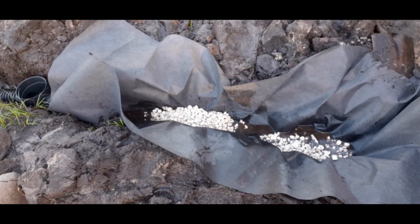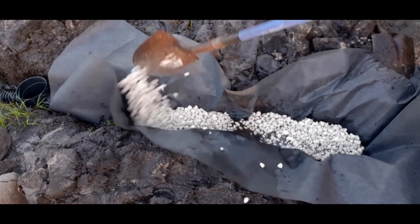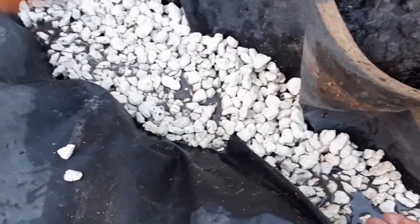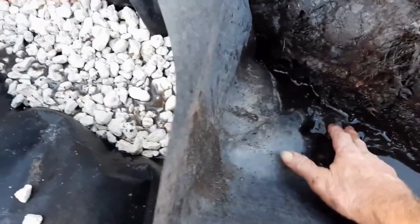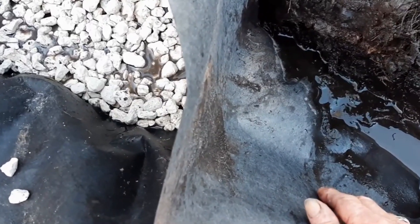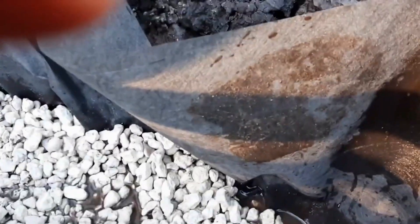So let's build a French drain the right way. We need a base of gravel under our pipe — that gravel allows water to flood up into your pipe without any obstruction. You can see the gravel and there's water getting through that fabric very slowly. Look at the backside — it's just packed with silt, and this is a brand new installation. Look how thick this silt is; it is just like a paste. There's no way that water is going to get through there fast enough. That's another reason you need gravel on the bottom of your trench.